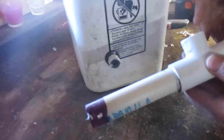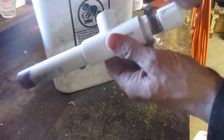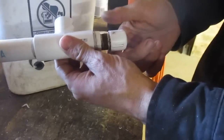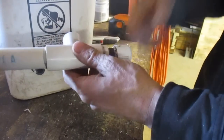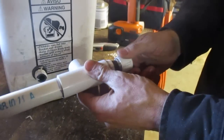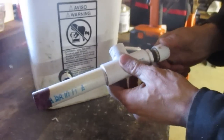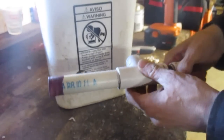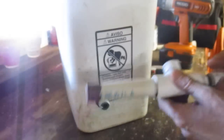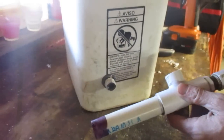Now what we're going to do is we know that the feed pipe for us is going to be three-quarter inch. We've got a stub piece here and I purposely put a T fitting here along with a cap, so that way in case I ever need to extend water out or do anything else different long term. There's a small hose on the end and about once a month we go ahead and clean these out because there is a little algae growth that happens. I'd like to put a valve on here and then just clean out the bucket.